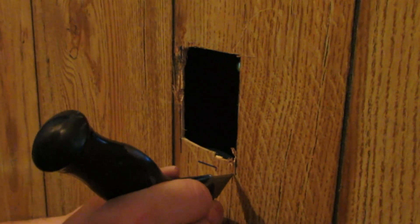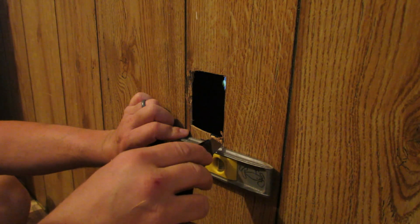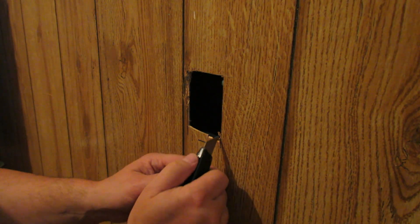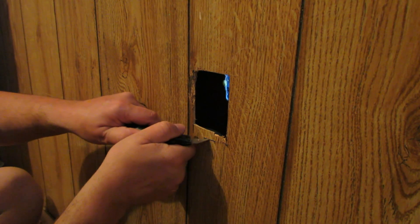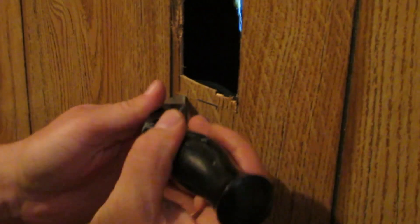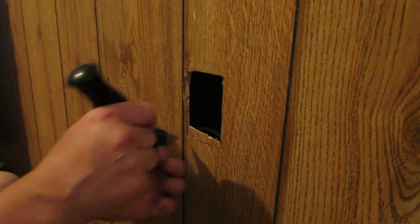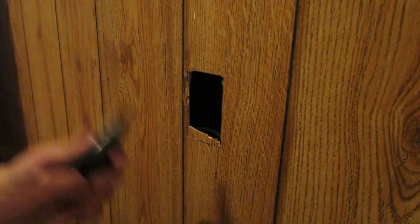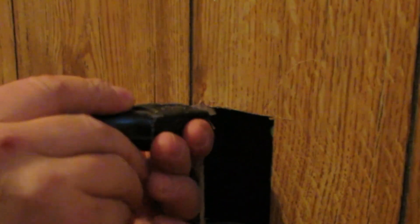What we're going to do is come in from the bottom here, pretty much where the line needs to be for the box. You can see when I stopped my marker I knew how far I needed to come down. Then to come across, we're just going to start right there at that hole, make multiple passes, come right through that line, and then back this way. Then down along this side we're just going to shave that off a little bit and score it. When you get close to the edge I like to come backwards with the knife — that way when the knife slips it won't do damage. This corner up here needed to be cleaned up a little bit.